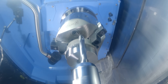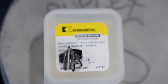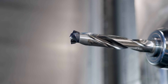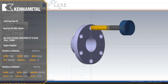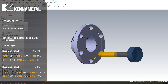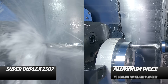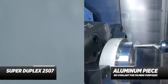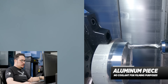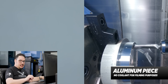For the next tool, I'm going to be drilling six holes on the face of the part using a 0.634 diameter Kentip FS drill. I'm going to be running it at 148 SFM, which puts it at 900 RPM. For the feed rate, we're going to be going 10.4 inches per minute. I've got to make sure that it goes all the way through the surface that I'm drilling, so I have a tip compensation telling it to go 300 thousandths further than the Z depth that I select.